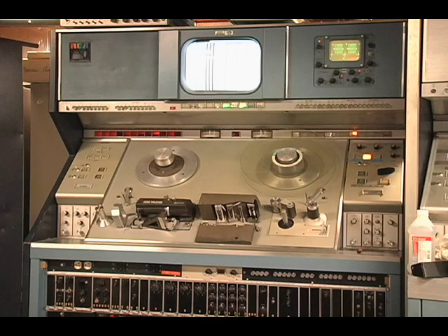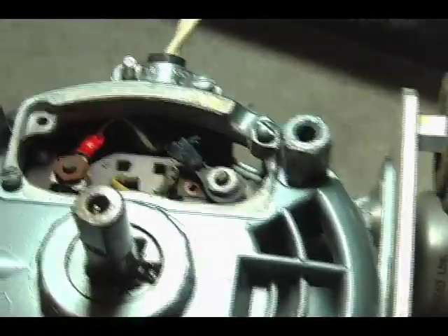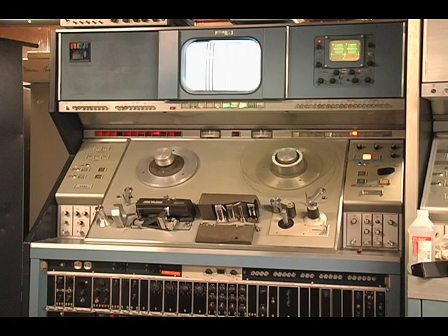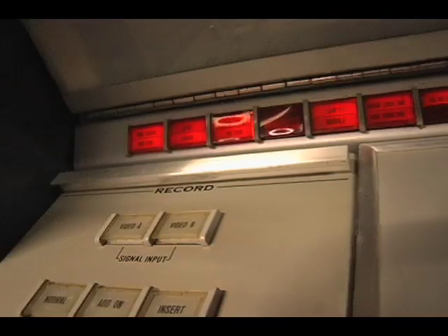I did find in the stash a brand new NOS, in-the-box vacuum pump blower motor. The first thing I did was pull the old one out, and I saw there was some burned wire on the terminal strip where the AC comes into the motor — I thought that was the problem. So I fixed that and put the motor back in, but it still didn't work. Out it came again, and I put the brand new motor in — and voilà, it came up perfectly. Great vacuum, the cooling blower is working, and the cooling blower warning light is out.